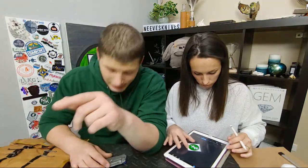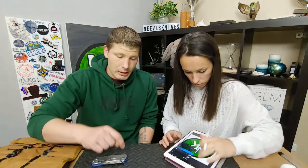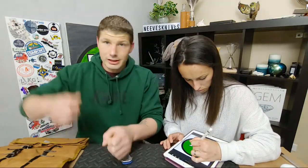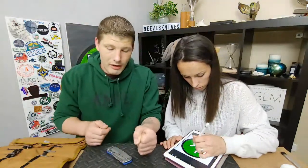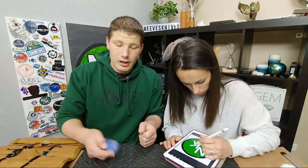Try that first. Second thing, you can use a heat gun or a wood burning gun, something like that. Just some type of heat gun, and put it on there. Next thing, which is probably the most important one that usually works: take your bit, make sure it's straight, get a hammer, and smack the back of your screwdriver. Because if there's Loctite in there, it'll just shatter it, and then you can open it up. Now, don't do the heat gun and then that. Try the hammer with the bit first. If that doesn't work, then use the heat gun and also the pressure thing. Try all that. It'll work.